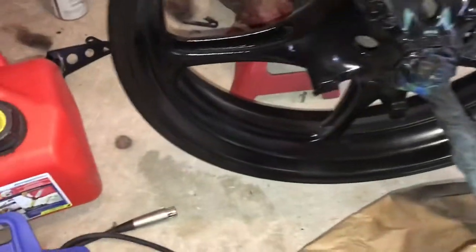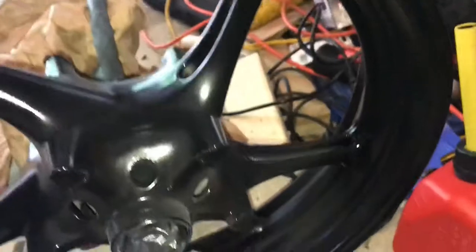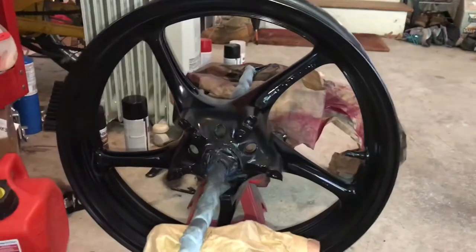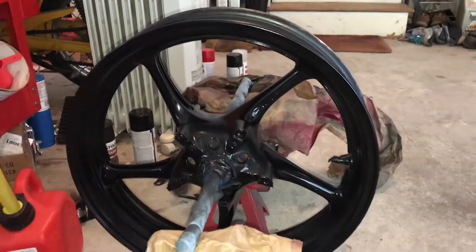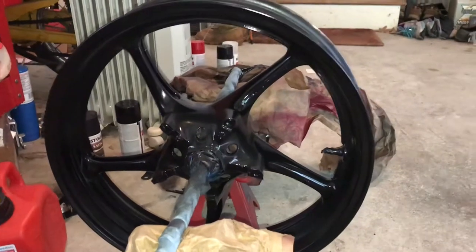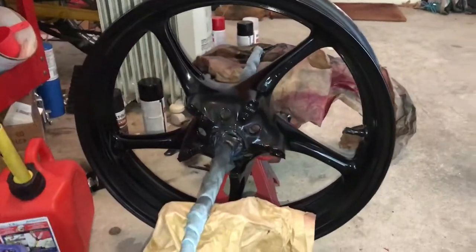Here are the results. I just put the last clear coat on today and it looks pretty good — nice and shiny, with a nice uniform coating all around. To recap: I put a clear coat on, let it sit for about two to three days, then put another clear coat on. Between the initial enamel hardening and the first clear coat, I waited two days. That gives the enamel paint time to cure and fully dry, with no chance of previous paint color floating to the surface.